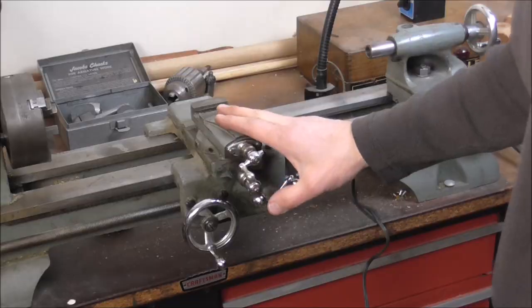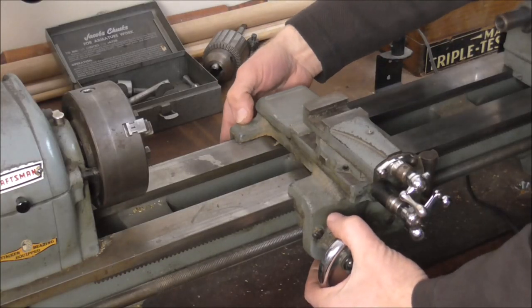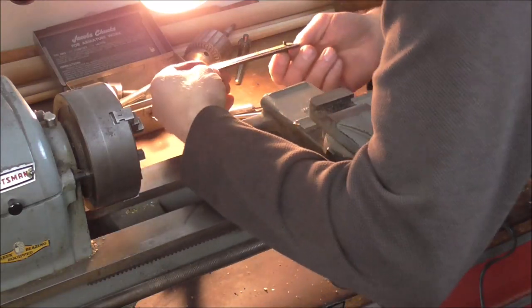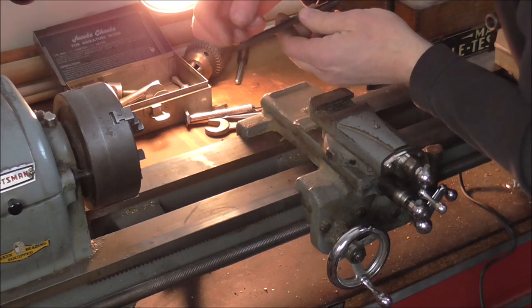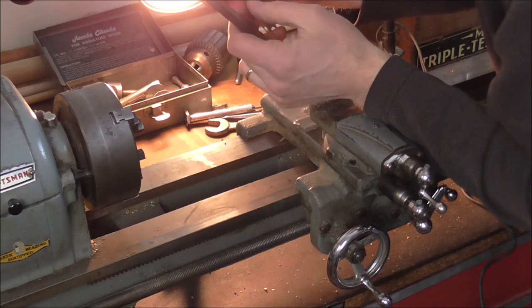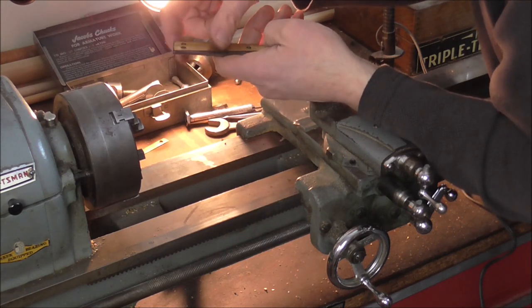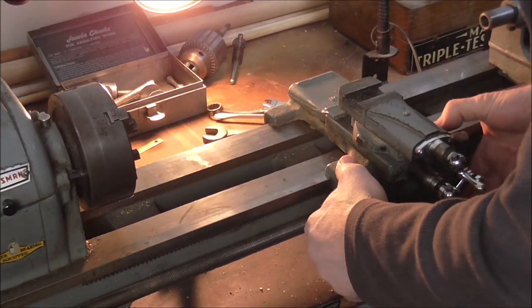Now I'm going to do the carriage. I'm going to start with the main body of the carriage — that's the up and down motion. There are some screws back here that look like they might tighten that up. I took off three screws and this piece came off. There are three shims on there. I'm going to take off the thinnest shim and put it back together and see if that tightens it up. That is very tight now, so that is good.